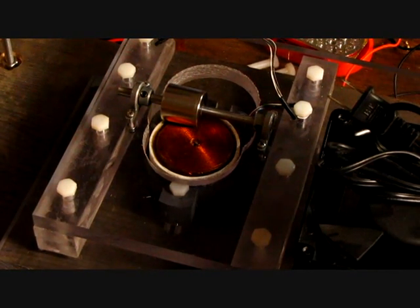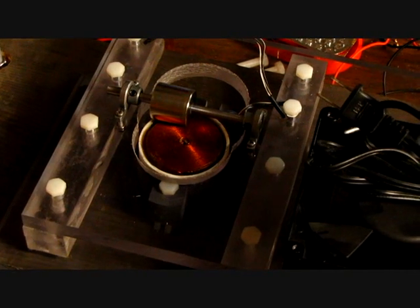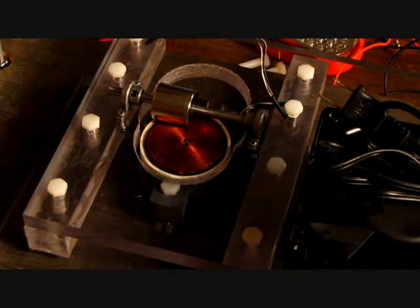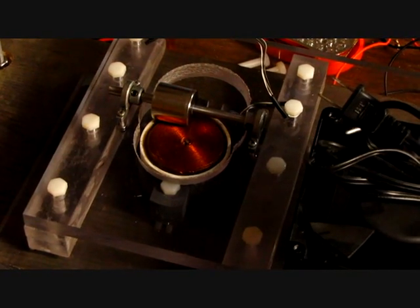If that doesn't work, I'm going to take one of the three remaining sets of single-wire pancake coils and reduce the number of turns to be equivalent to the original record-setting coil, because that one was about an inch and a half in diameter — thirteen coils like I have now, but only an inch and a half versus the two inches I have right now. It may have been that I'm just not getting it tuned right, or the Hall sensor in the correct position. All the planets and stars might have been lining up just perfectly when I hit 90,000 RPM, so it was just tuned perfectly for that moment. It might be really difficult to reproduce, but I think it's possible, so I'm going to keep on shooting for it.